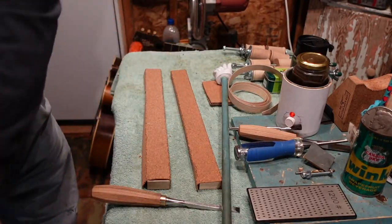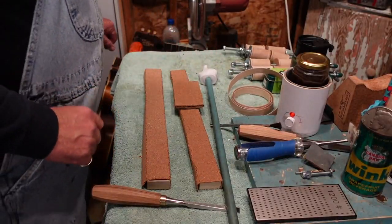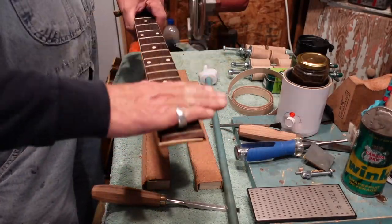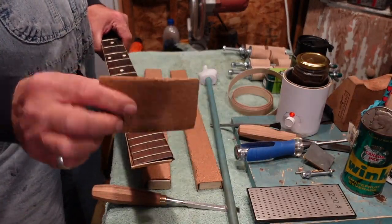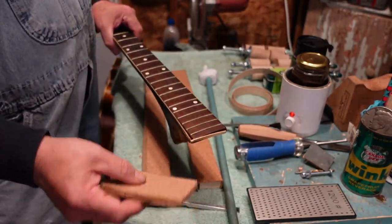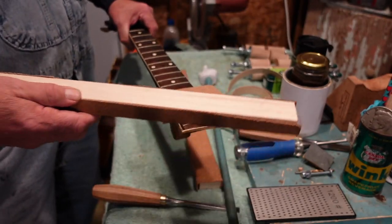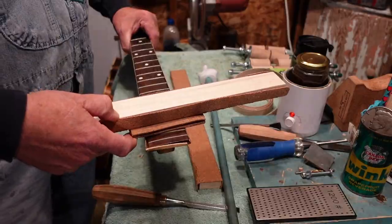We're going to need things to clamp the guitar without breaking it. You know that the neck and the fingerboard are radiused on this guitar. They're not flat like a cigar box guitar. So when I clamp, I'm going to clamp down into this area. I'm going to need some cork paper stacked up. This is adhesive cork paper stacked up with the last one turned the other way. I can put this on here, put pressure down by using corked neck cutoffs like this, and it will apply pressure and it will adjust itself and compensate.